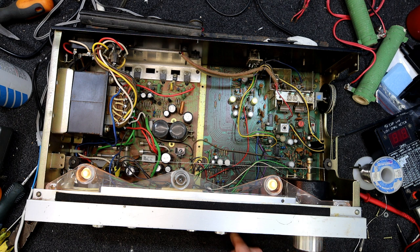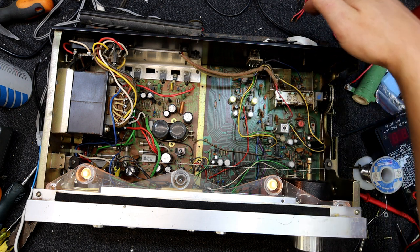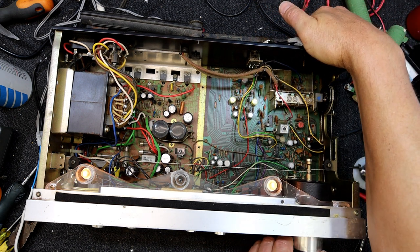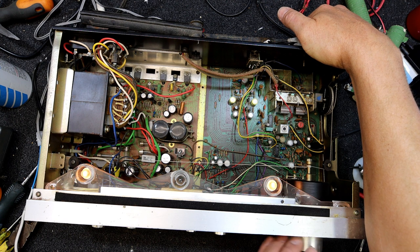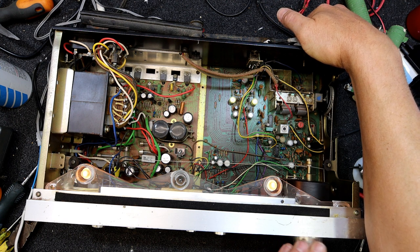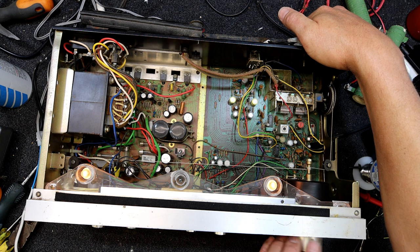This is only for parts but it would be interesting to see how much I can get working. The phono is humming so that's a good sign. FM — I'm not hearing much. Oh, muting off — so the muting was all that was stopping it. Sounds like it's going to work. There might just be picking up a lot of rubbish without an antenna. It doesn't like turning all the way to the end either — something's not happy with it.